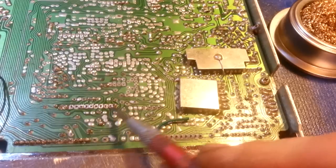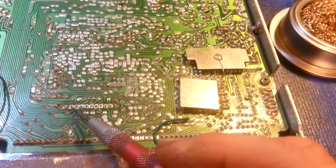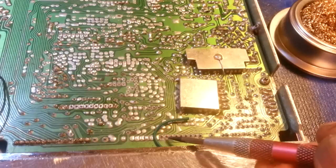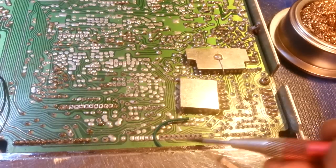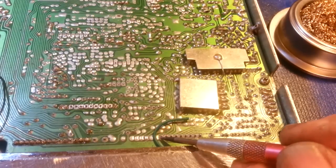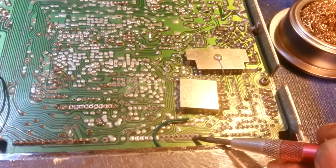What I like to do is desolder and re-solder the end pins first, then come back and desolder all the rest. I don't want the pins or the whole connector to fall out the other side of the board, so I'll desolder the two end pins first, clean up, re-solder those two, then do all the remaining ones in the middle.